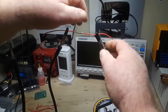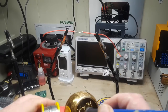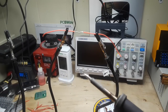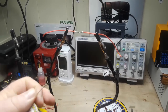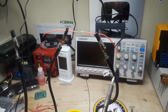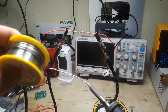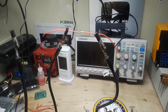When you're soldering, you want a little bit of tension on the wires. Next, make sure your iron is clean — whether you use a sponge or brass wool, make sure your tip is shiny. Once you've done that, tin your tip. I'm using TMI American Solder, 60/40 rosin core, 0.8 millimeter or 0.031 inch. Just tin the tip — not a lot, but enough that you have some on there for heat transfer.